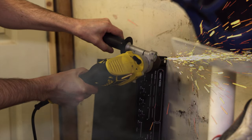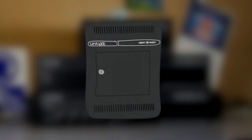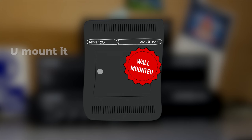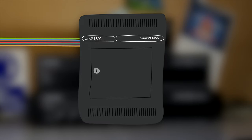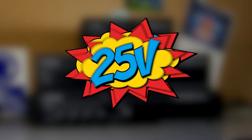Tired of trying to put rack-mount equipment on a wall? Don't worry — they've got a wall-mount version, the WMA-4300. It's exactly the same, well, not exactly the same: it's wall-mounted, that's what WMA stands for. And UMA stands for U-mounted, or something. With the wall-mount, you can buy the backing box separately so you can sling in the cables during construction and bring the amp in when everything is less dusty. These bigger amps can all drive low impedance as well as 100-volt, 70-volt, and even 25-volt line.